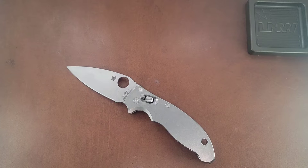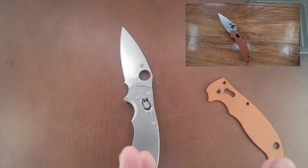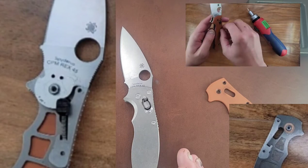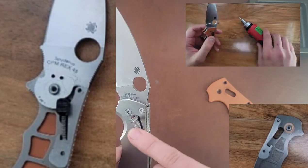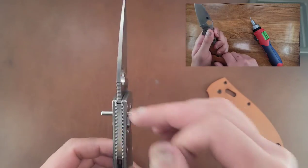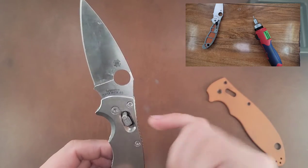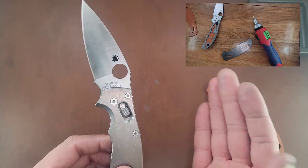So we took apart the G10. I'm sitting here taking it apart, I get the G10 off, and I'm looking at the cage. It's not hard and it doesn't pop out at you right away, because the way this cage holds the spring — which holds the detent ball, or the ceramic ball for the cage — it's tied into these four screws. When you loosen up this screw and back it out, this will go boing. In order to get it out, you have to do that. You can't even take off the blade without really loosening this up.